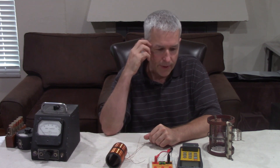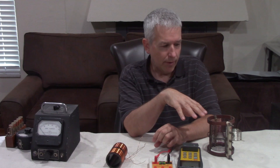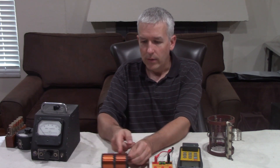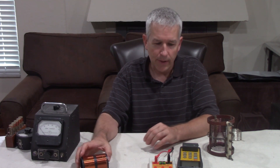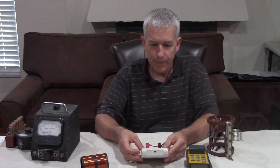You can do the same thing with an oscilloscope with a sniffer coil. You make one loop of wire and place it above or beside the coil in different positions to look at the frequency and the resonant frequency. As you tune your coil, you will see higher output when you reach the resonant frequency.